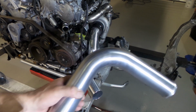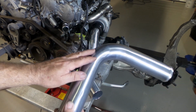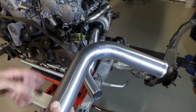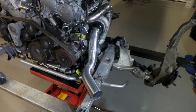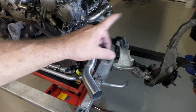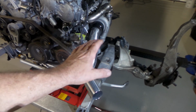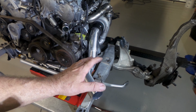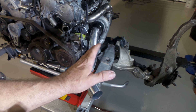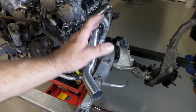And it's the same for 180s. A lot of these packs will have two 90s, two 45s, two straights and two 180s. And the 180s, basically if you cut the 180s in half, I'll just go and grab a 180 and I'll show you. Alright, now I don't have any 180s, I must have already cut them up, but you can imagine if you've got a 180 degree bend like a horseshoe, you cut it in the center and then weld a straight leg on both pieces, you've got two 90s. What I'm getting at is if you need a 27.5 degree bend, and if you can't get that, you can just make it yourself out of a 30 degree bend or out of a 45, out of a 90 or a 180.